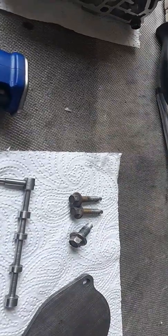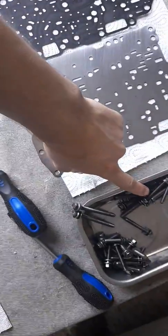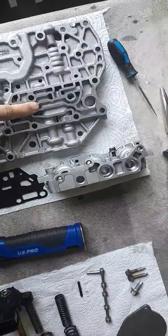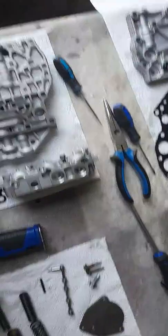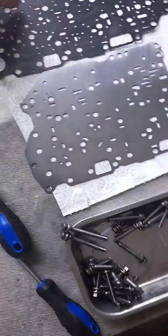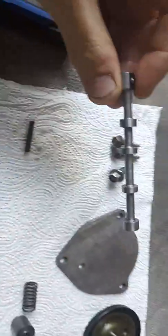I'm going to show you where all these parts come from on the gearbox. The valve body is held on by all these little bolts and five big bolts that hold it down to the casing. The bolts go through the other side. It's very simple when you put it all together — first that goes on, then that goes on top, then that on top of that. You've just got to torque all the bolts up to nine Newton metres. This is the manual valve.